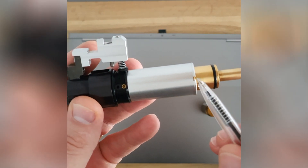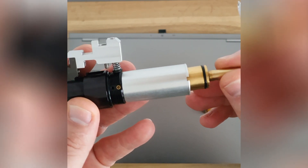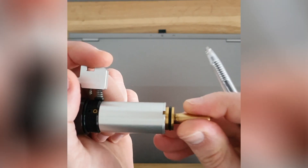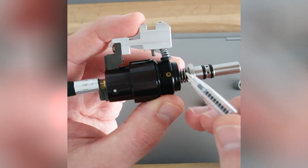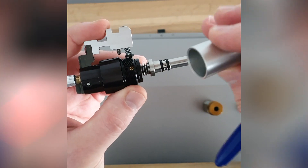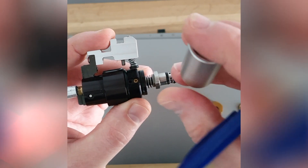If you can see here, there is a small gap. This gap allows the pressure to push in this direction and retract the nozzle. The nozzle retracts, and as it retracts it resets the spool into the backwards position. With the spool in the backwards position, air is allowed to go through the metering screw inside the engine and into the dump chamber. The dump chamber basically consists of this cylinder, there's a middle part which is made for the sealing, and the air fills all this compartment.